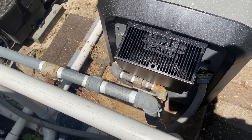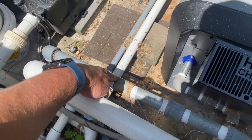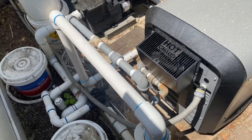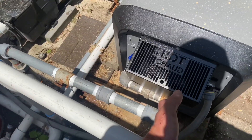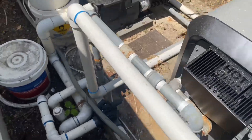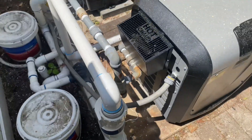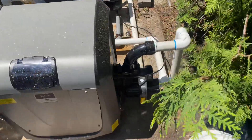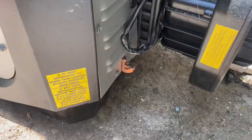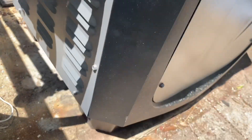You can see they started it right here with this coupling. There's a lot of unnecessary piping that's not needed. There is a gas valve right there and it's in the off position. Focusing on the right side of the unit, we're going to see that it's not electrically grounded — and checking the other side, nope, there's none there either.